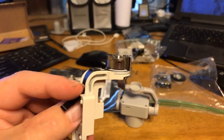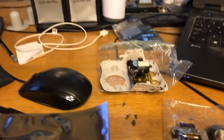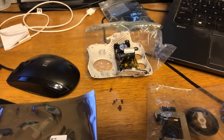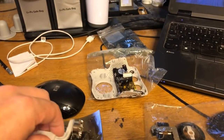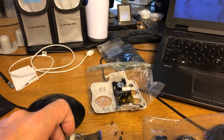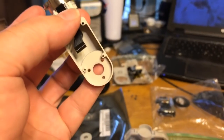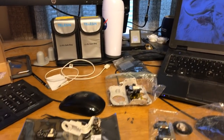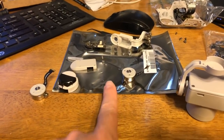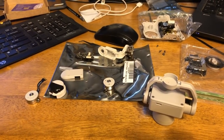And start working on, I think what I'm going to try to get done, at least today, is to get the yaw motor back in the frame over there and get the seals and everything else in place so that it's all back together and underneath the drone, so that all I have to do is basically put these final screws in place, attach one cable, put the board on, and then just snake the new flex cable through, which is inside this bag. And I have confirmed that the flex cable is the correct one.